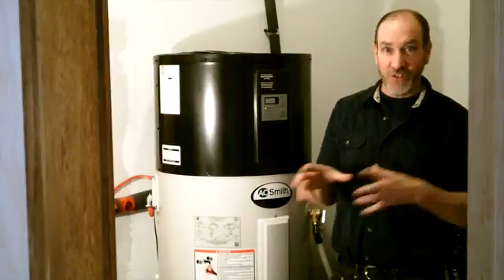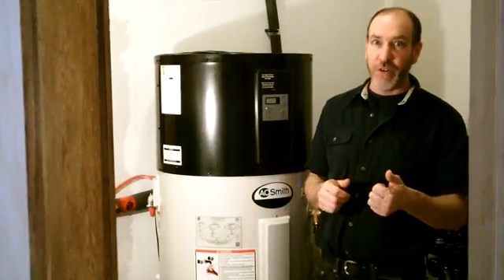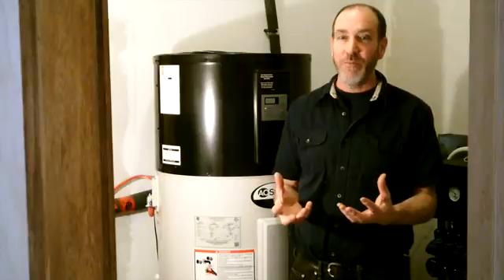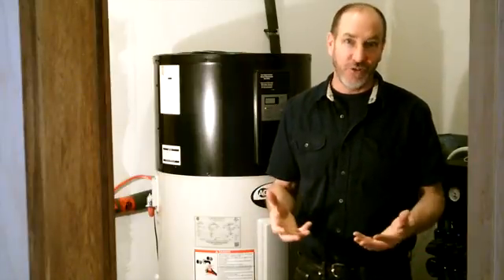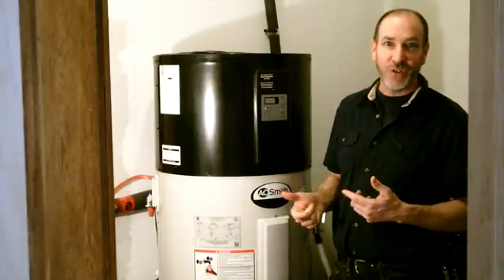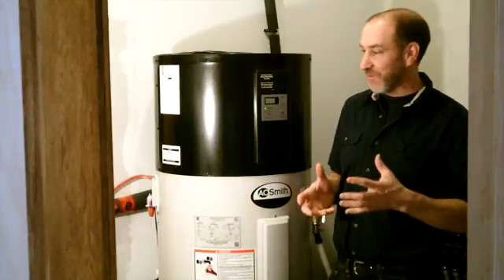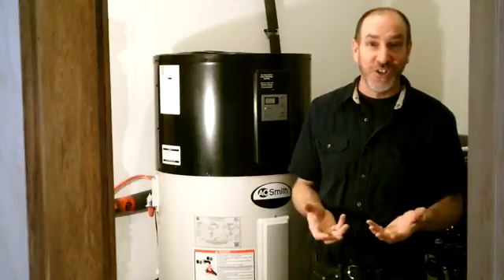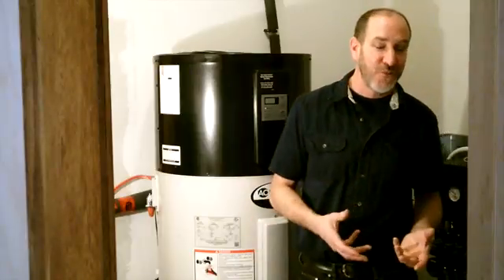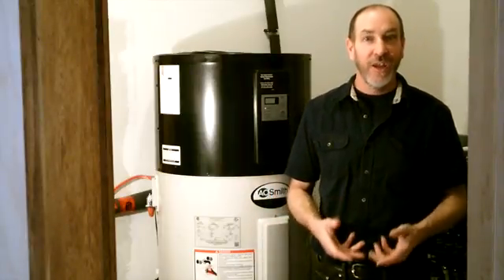To understand what's going on here, you need to understand heat pumps, so check out our other video if you haven't seen that yet. We have an air source heat pump that heats the air in the house about three times more efficiently than if we generated it electrically. What we have in here is a Voltex hybrid electric heat pump water heater from A.O. Smith. Rather than relying on coils that heat the water — which gives you normal electric resistance efficiency, kind of one-to-one — heat pump technologies tend to give you an efficiency closer to three-to-one, meaning it's three times more efficient and therefore three times cheaper.